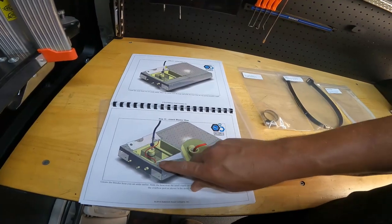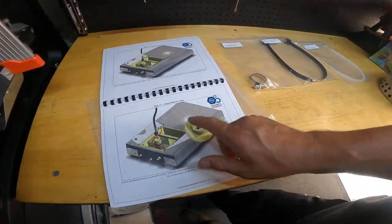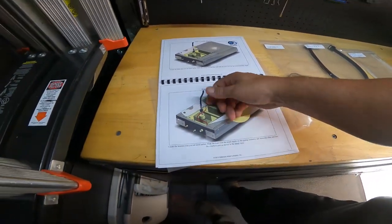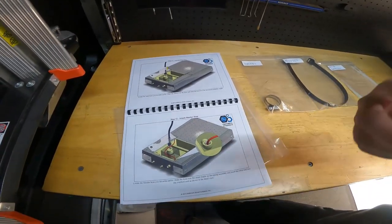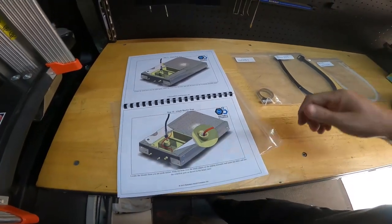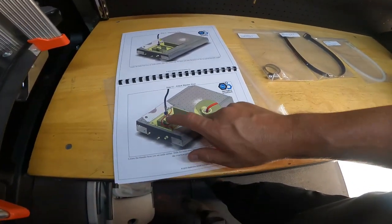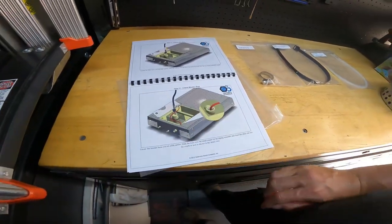It has this little bleed valve, this right here. This is very important, you guys. You need to make sure you put this thing back in here when you close your lid, and just crack this thing, just let it bleed off so you're bringing some fresh water in. If it's recycling that dirty water all the time, your conductivity is going to go through the roof and you could start fouling up your pads super fast. So you want to make sure that you have this bleed on here. That's why there's no chemical treatment in here.